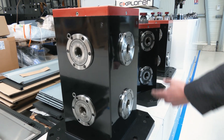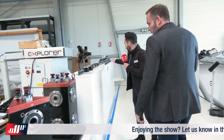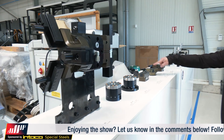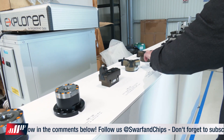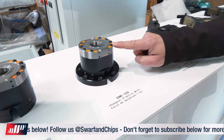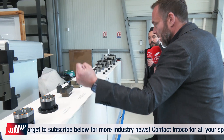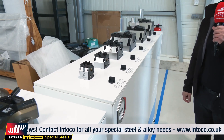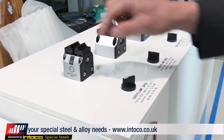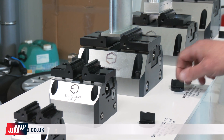They can do any sorts of cubes, tombstones, triangles — you name it. So perfect for horizontal machining. It will also incorporate the vices they offer. Before we get to the vices, we can look at some of the gripper options that are available. You've got some gripper options here — and this is an interesting gripper option for the zero point, to load the pallets. This is what you see on all the Easy Box solutions — they use this to actually grip the pallets, pick them up and move them. The centric grippers here are a new design — pneumatic vices — and they work well with all robotic solutions.